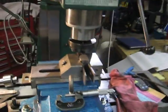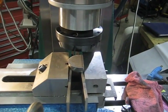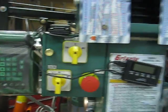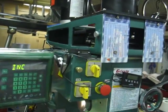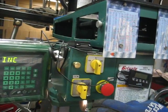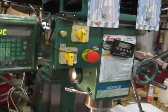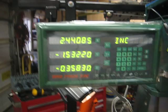I'm set up here on my counterweight that I'm making for this engine. I've got a fly cutter installed. I have a variable frequency drive installed, two-horse motor on the back. I retrofitted this mill — instead of single speed, I wanted variable speed. I added a potentiometer right here, and the motor works. Had to rewire the entire mill so that I can hit the red button and everything stops.